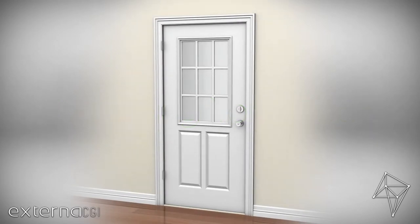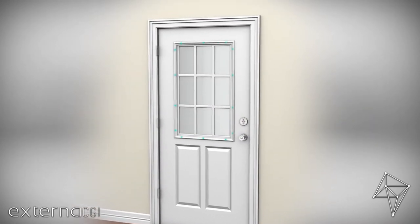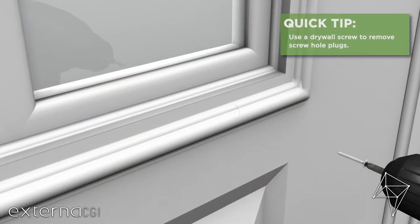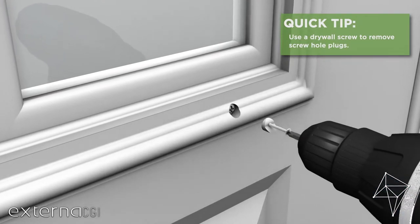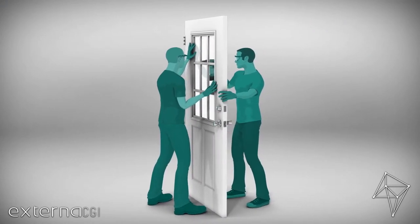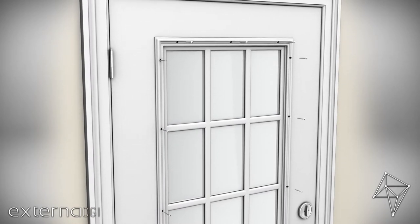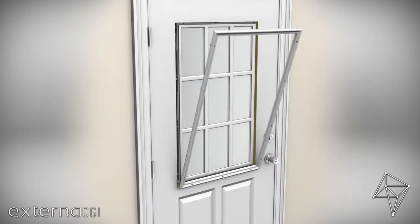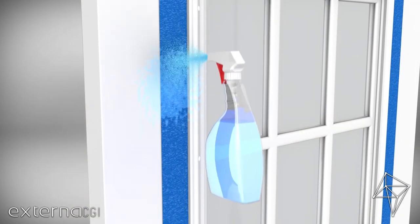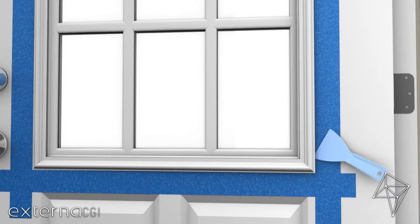First, find the screws on your existing frame — these are located on the inside of your door. You may need to remove old paint, putty, or caulk to get to the screw plugs that cover the screw heads. Use a drywall screw to remove screw hole plugs. Make sure you have a friend standing outside the door holding the frame as you loosen the screws. Completely remove all attachment screws and remove the inside frame. To remove the outside frame, use window cleaner to help release the caulk. You may also need to insert a putty knife between the frame and the door.